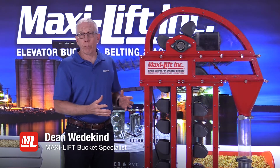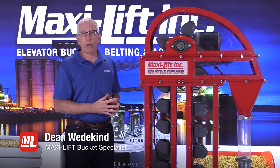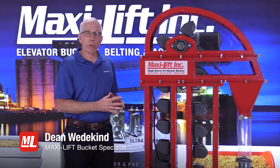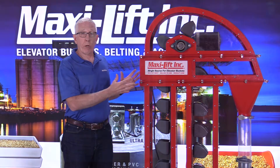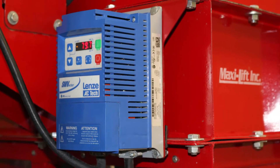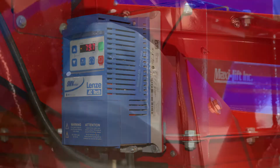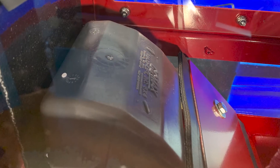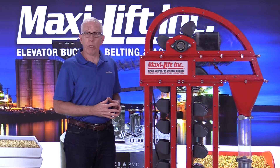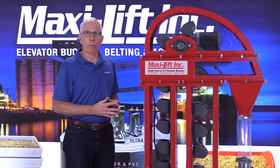When we talked about the head section I briefly mentioned a variable speed drive. Today we're going to hit a couple of the accessories for your bucket elevator — one is the variable speed drive, which is more high-tech, and another is very low-tech, and that is the throat plate in the discharge. Both of them could be very important in determining the rated capacity of your bucket elevator and having it function properly.